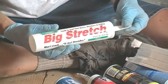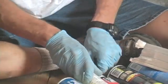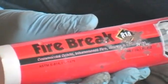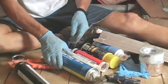Good quality caulking can be just something like a painter's caulk, as long as it stays pliable over time. Another one is fire type caulking. This is going to be fire resistant and used around masonry fireplaces or hot exhaust pipes for heating appliances.